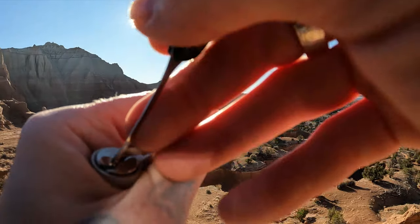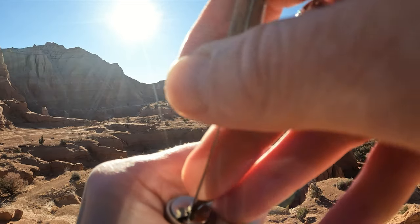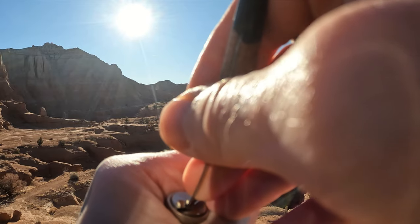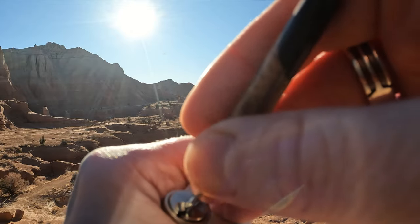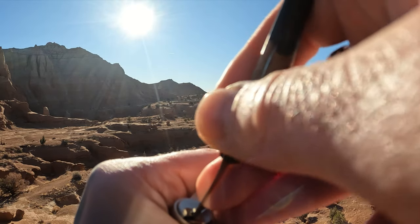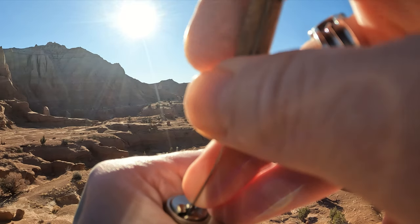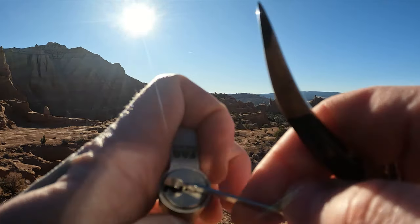That's our tension setting in place. So we're just going to stick a pick in and let's have at it. Pin 2. Pin 5 — nice set on pin 5 there. Pin 1. Pin 3. There we go. There's our open.